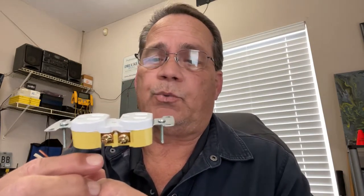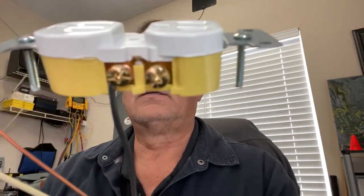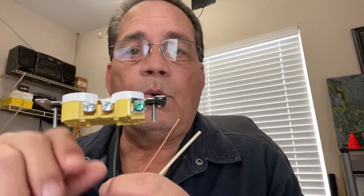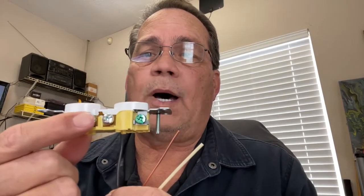I hope this is going to help you make it easier to wire an outlet and a switch. Because you don't want the wire stripped way back with all that bare wire past your outlet or switch. A little quick tip: the brass colored screws on that outlet are going to be your hot wires — the black. On the other side, you have silver screws — that's your neutral wires, the white. Another way to know you're wiring it correctly: your neutral wires are always going to be on the same side as your ground.